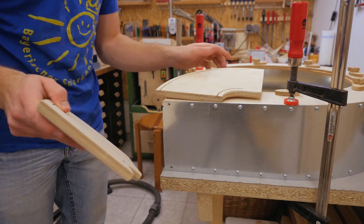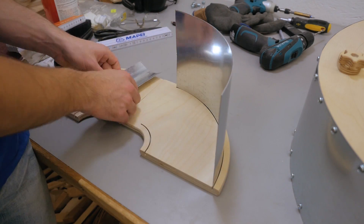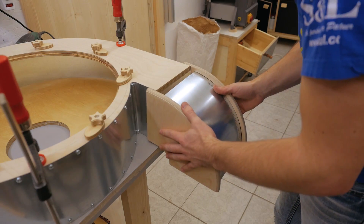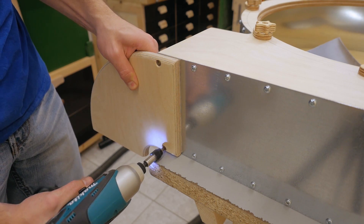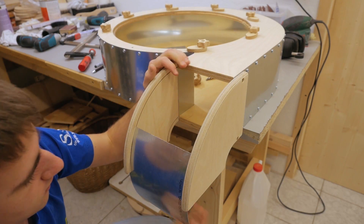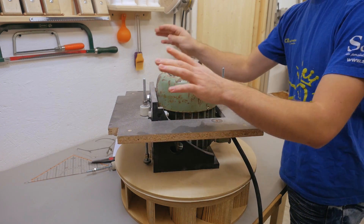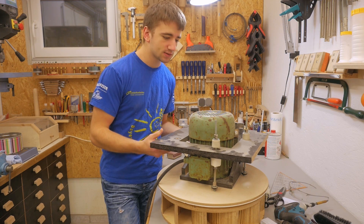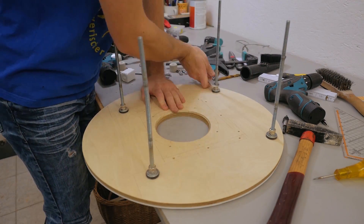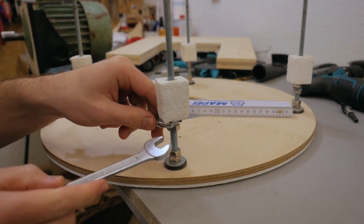For the 90-degree transition I made these pieces which fit like so, and for the screws I'll use some more sheet metal that I already bent to shape. I've placed the screws so they use the already existing holes in the metal. To hang the dust collector from the wall I previously had threaded rods screwing into a plate with T-nuts, and the whole thing could slide onto angle brackets on the wall. That worked really well so I'll reuse this concept.